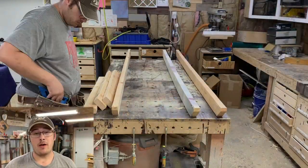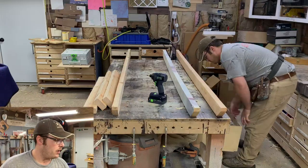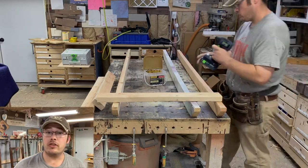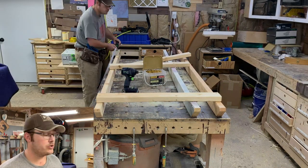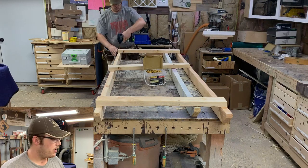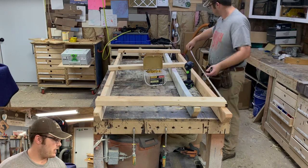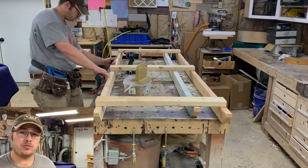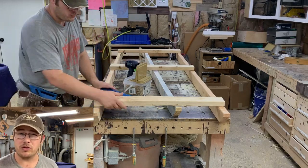I'm cutting everything to size — oversized for my dimensions — based on that diagram. I lay out the boards and come in about 4 inches on one side to ensure overhang, then attach each spreader with one screw on both ends. The reason I only put one screw initially is so I can square it up later. My finished work piece is 74 inches, so I make the two end spreaders 76 inches — 2 inches bigger — giving the furniture room to sit with a little extra buffer so no corner hangs out in open space risking damage.